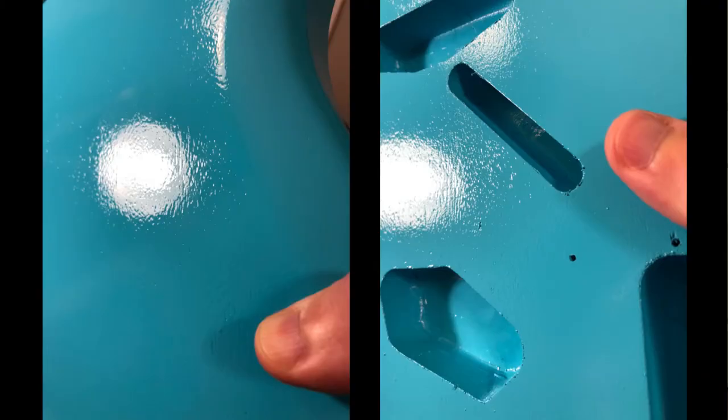You're going to see now a closeup picture. When you look at the reflection of the light shining in there, you can see very clearly the divots. The texture you're seeing is not what people refer to as orange peel — that is the grain of the wood itself. Orange peel is a much subtler effect from the droplets of paint hitting a flat surface. What you're seeing right now is wood grain. Those are divots in the wood itself.